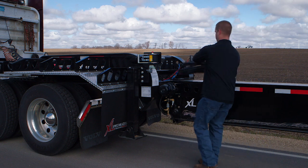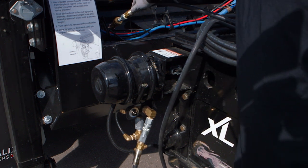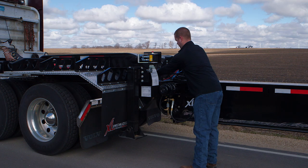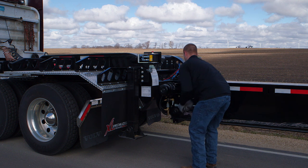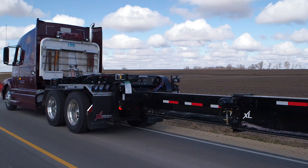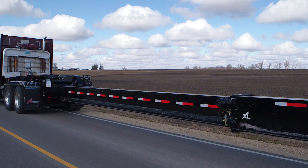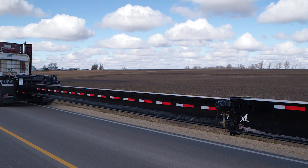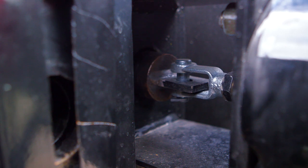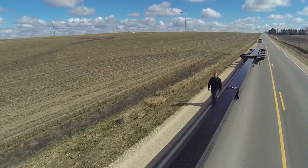The third beam locks into place using air locks. To extend this beam, momentarily hook up the air hose from the gooseneck to the air locks. You'll find the air locks between beams 3 and 4. Ensure that the air valve is in the off position. Move the truck forward to extend the beam, and then turn the air valve on to engage the lock pins into one of the stop points. Drive the tractor forward or back until it locks into place.